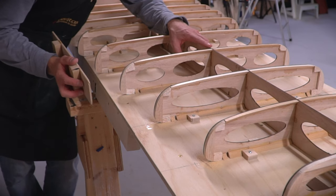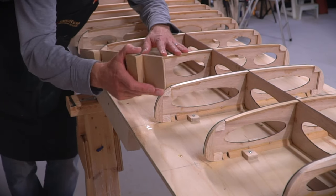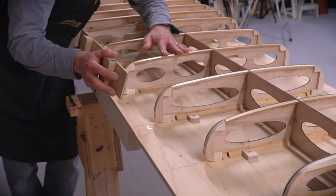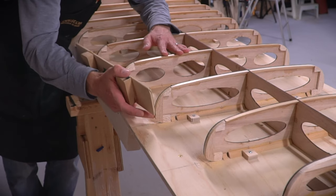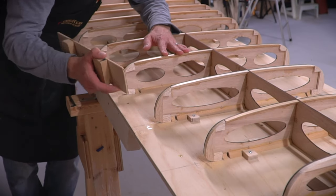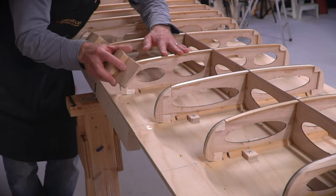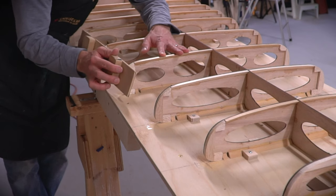The final step I'm doing for preparation on these frames is to use a fairing board to bevel the edges of these reinforcement strips, just so that when the outer strips are put on to the board frame, they'll sit flush against both the frame as originally cut and it'll maximize the surface area for gluing. So I'm just going to go through each one and gently bevel the edge until it matches the curve between each frame section.